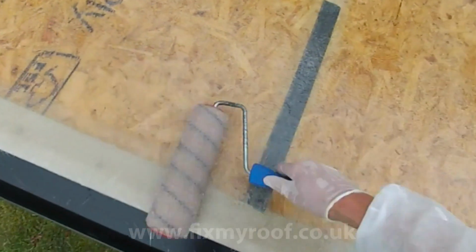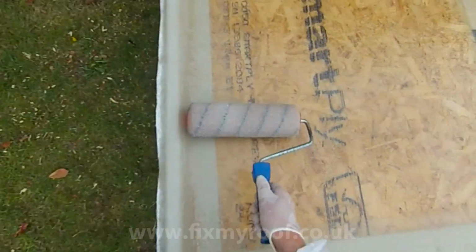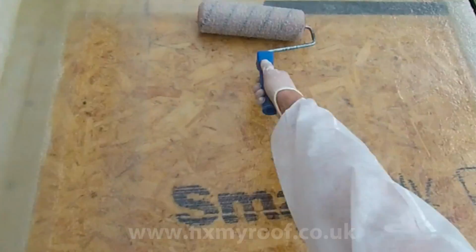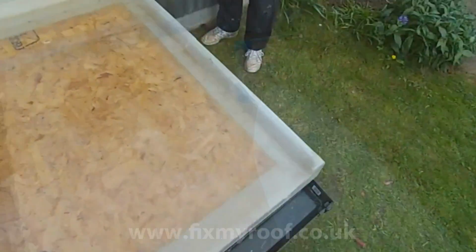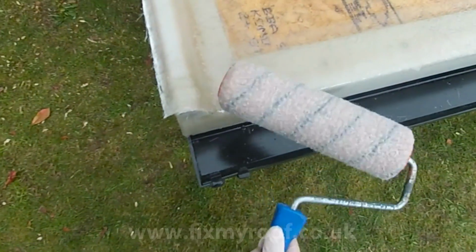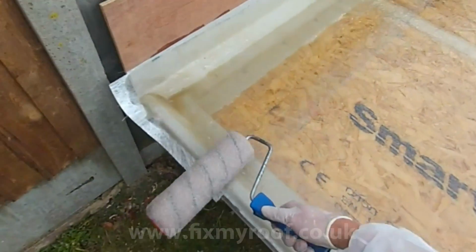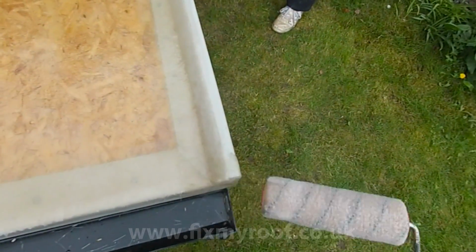Once again, I tend to pass over the laminate one last time after consolidation with a wet roller. It's not strictly necessary, but it makes everything flat and knocks any sticky uppy bits back down. As you can see, you can actually be surprisingly delicate even with a large roller like this. And there we are, done.